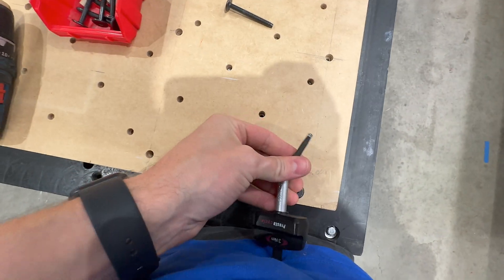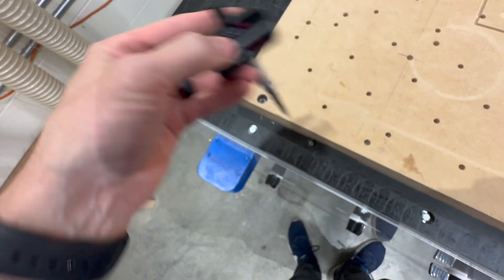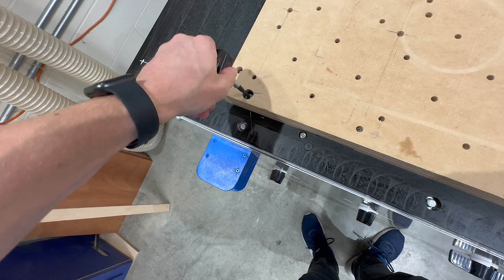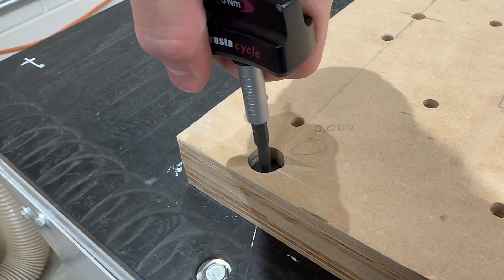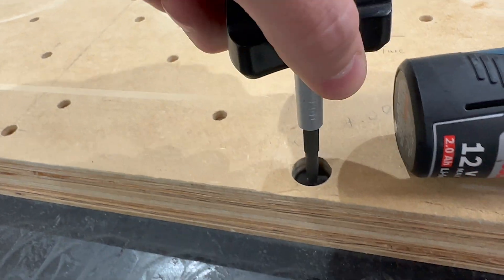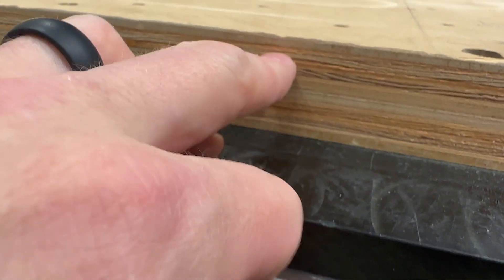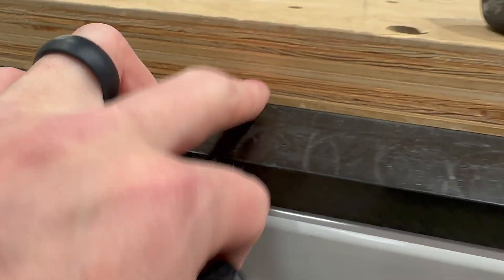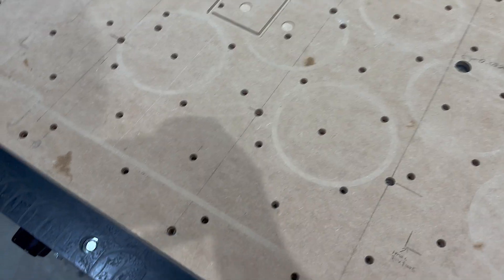You don't want to strip the threads down in the steel below — that's a real problem. We use a torque wrench set to 3 newton-meters so you can't over-torque it. It twists and releases once you hit that limit, especially important because we're tightening down into armor core — MDF with a little plywood in between — which you can really compress too much. This keeps it nice and consistent.